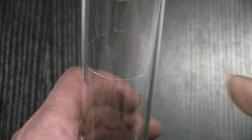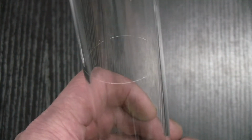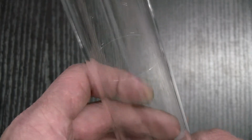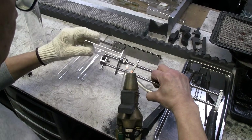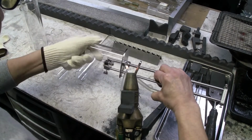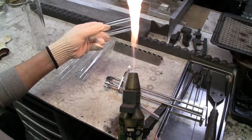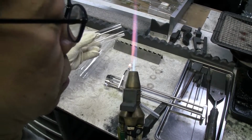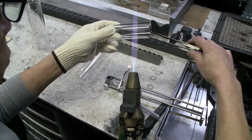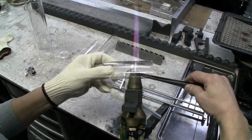Do not roll the cutting wheel over the beginning of the cut. One rotation of the glass tube is enough. If you rotate more than once around, the fracture line will get very big and white. This wears the cutting head and leaves a line of bubbles when sealing the tube onto something else. A perfect fracture line is clean, has no crushed glass, and is ready to seal. It will leave no bubble line in the finished seal.